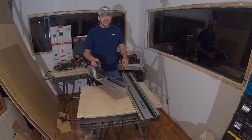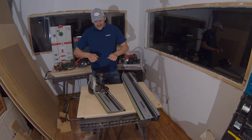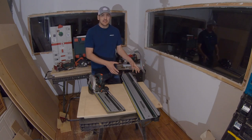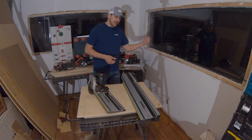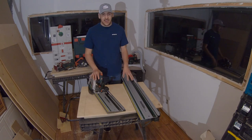When you're doing your window trim on the exterior of a building, you could easily just grab this, throw it at 45, 16-foot long material, and you're not having to fight it onto a miter saw, get it set up, get it butted in and perfect. You could just walk over to the pile of material on the ground, boom, boom, boom, boom, 45 all the ends on one side, hook your tape onto it, pull to the other side, make your mark and make your cut. It's that much faster.